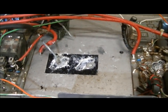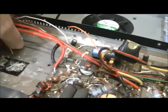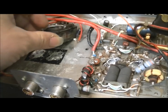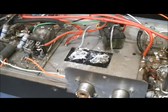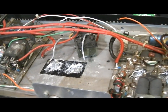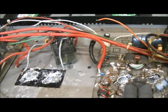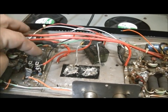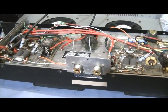One board is completely missing — I can't remember if it was sent with it, it may be in the box. The relay here is intact, which is good — this is a very expensive relay, you could pay up to $40–$45 to replace it. I can tell this relay has gone bad and someone replaced it and added a different keying circuit, so we're going to strip all this out and build a Sweet 16 from the ground up.